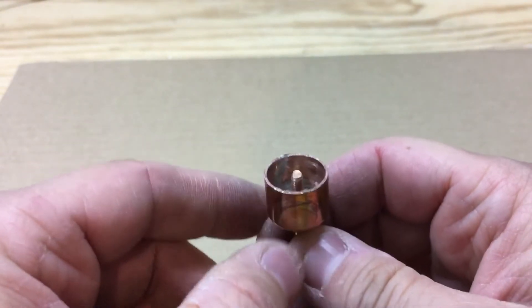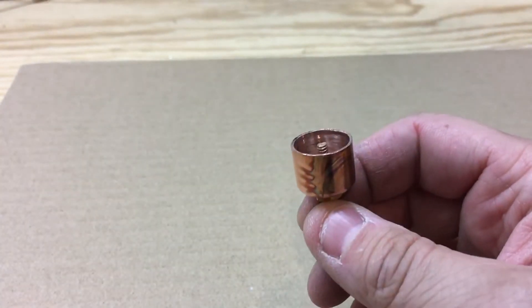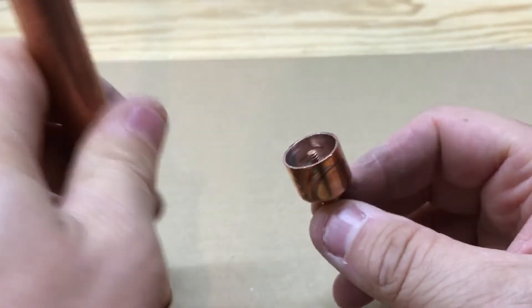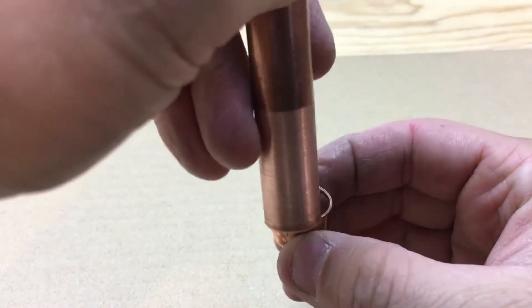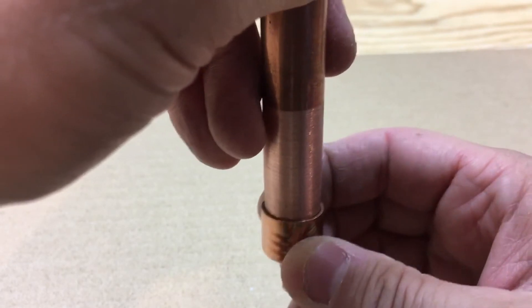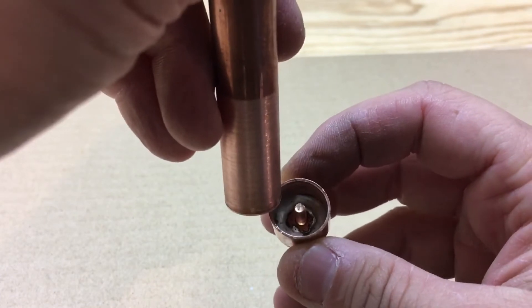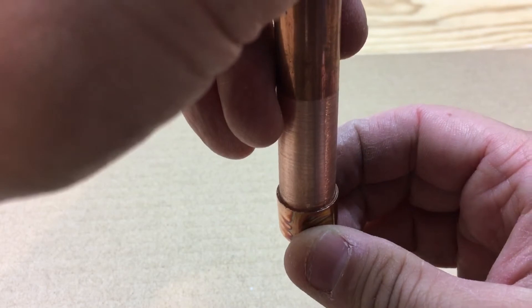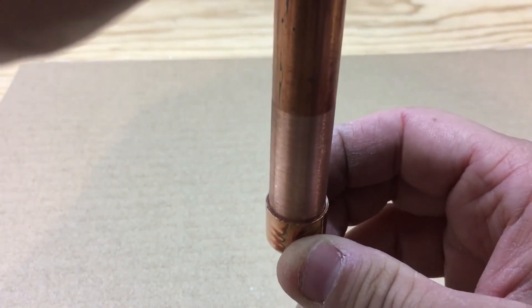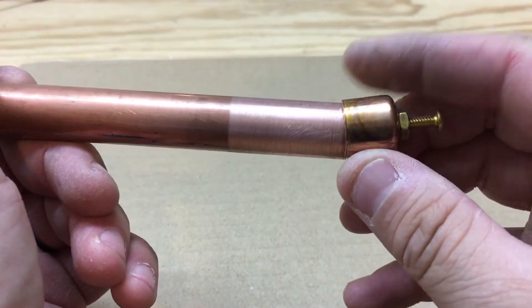I did a trick on making the J-pole — I took the short piece of the J-pole and put the cap in my vice, then soldered it upside down, so if the cap got hot enough and started re-melting the solder it wouldn't go anywhere. If you do it sideways, obviously the solder would run out around the nut.